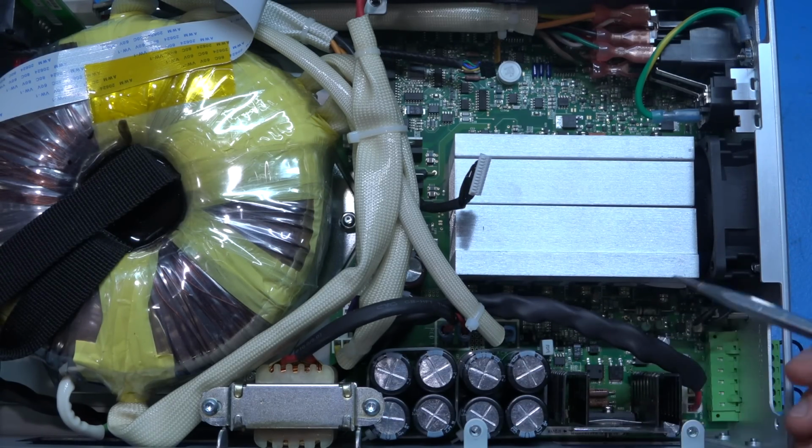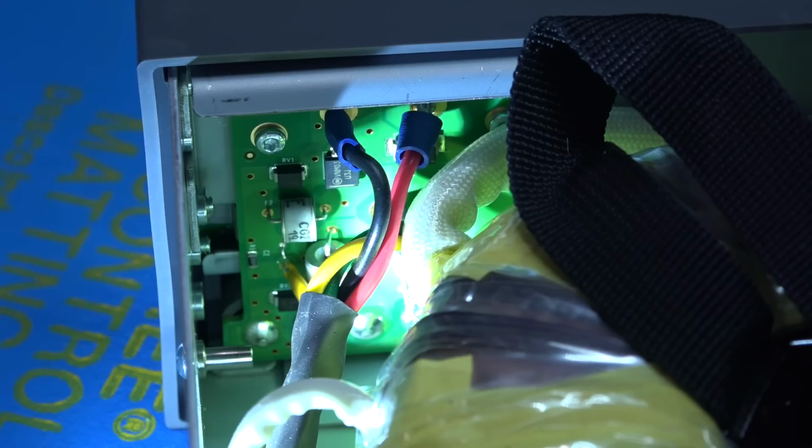And there are a lot of devices that are connected on the side of this. And here's the interface to the front panel, and you can see a couple of protection diodes as well as spark gaps in there so that it protects the rest of the device. It's nice to see. As always, of course, Keithley has excellent protection circuitry built in at the interface of their devices, whether it's the SMUs, the multimeters, or the power supplies.